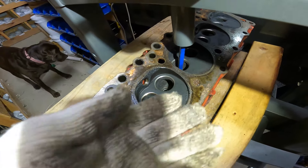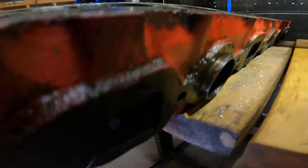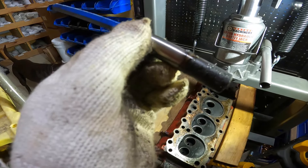There was a loud pop and I thought something broke, but it actually broke the guide loose. This is very difficult to show because of the angles — I can't get light down in there — but this one we're trying is starting to come out, it's starting to push down. It is coming out, so it does appear this will work, but it took some serious pressure, which explains why they won't come out just by beating them. And there it is — one guide out.